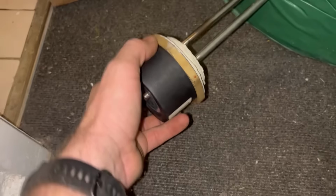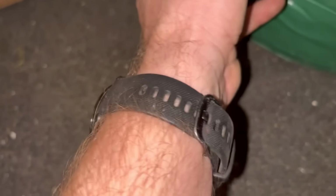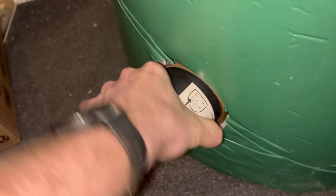So for the sealing, I've got the fibre washer, I've got some Loctite, I'm using Loctite 55 and some paste. Now, I've actually heard people using that rapid glue stuff on these. Don't do that. Don't do that. Next person that comes on, they are going to cuss and scream at you. So, just get that tightened in. And get the immersion spanner on it, get that tightened up.